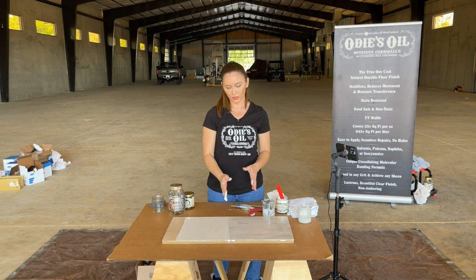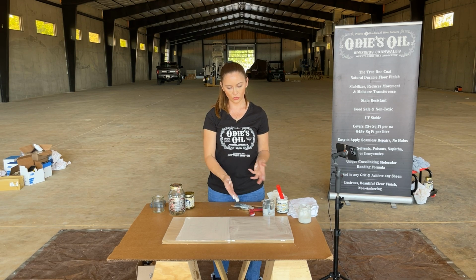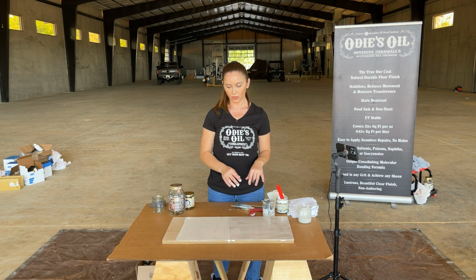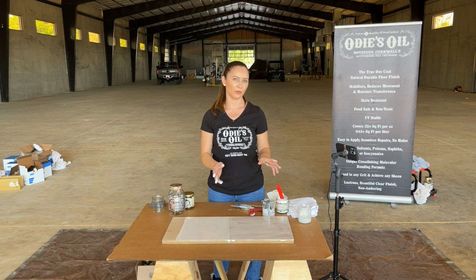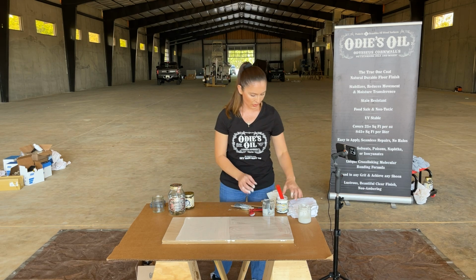And the longer you allow the stain to sit, you're gonna get a better color saturation. So in this case, you're gonna wipe off very quick, like in 5 minutes. However, if you want a richer stain, you can allow it to sit longer, so you're gonna get a richer stain, like I said. However, we always recommend to run some test pieces always. So yeah, let's wipe off now.